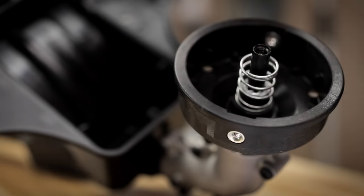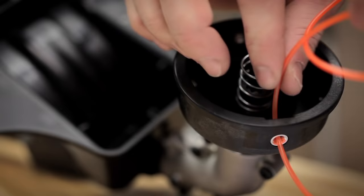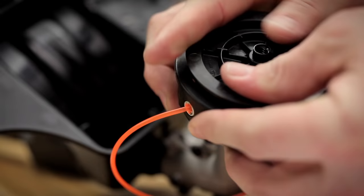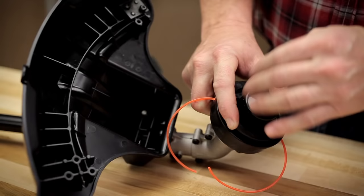Place the spring back on the shaft. Then find the eyelets on the spool head and feed the strings through. When placing the reel on the shaft, align those holding slots on the reel with the eyelets on the head. Holding the reel down to compress the spring, tighten the bump knob back on.